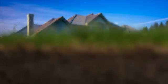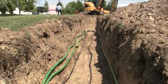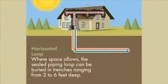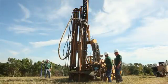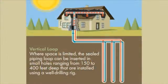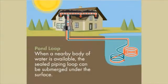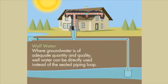There are several different ways to install a geothermal loop system. Where space allows, horizontal loops are the most cost-effective loop design for most homeowners. If space is limited, a vertical loop system is often the best choice. If a nearby pond or lake is available, a coiled loop system can be used — the fastest and easiest loop system to install. If a well is available that produces sufficient volumes of water, an open loop system can be installed, which takes water from the well, pumps it through the heat pump system, and returns it to the environment in a responsible, renewable manner.